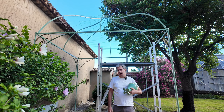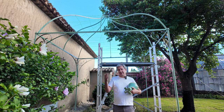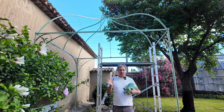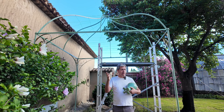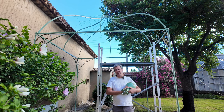I've had to spend quite a bit of time redesigning the system. And then basically what we do is we present that to an air conditioning company or place that sells them, and then they send over a guy who will do the final connections and filling it with gas and all that sort of stuff. So I'll be running all the electrical wires, the drain pipes, conduits, whatever you want to call it, and also the supply and return hoses, or copper pipes, for the air conditioning units. We're looking at having probably somewhere between 15 and 18 units inside.